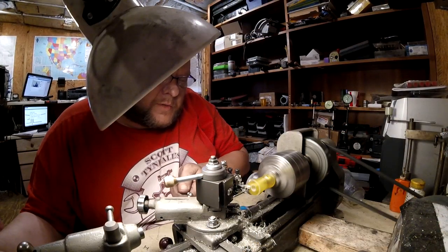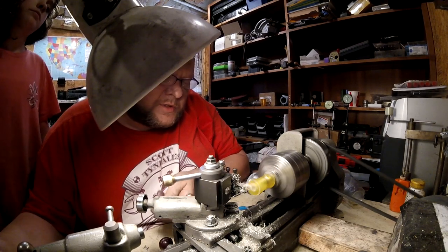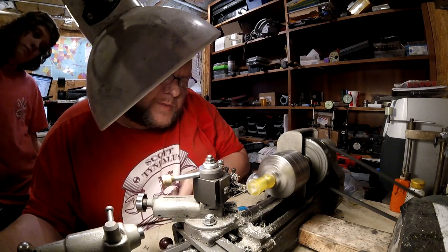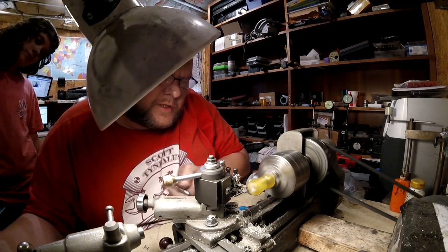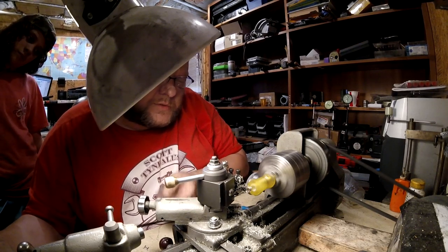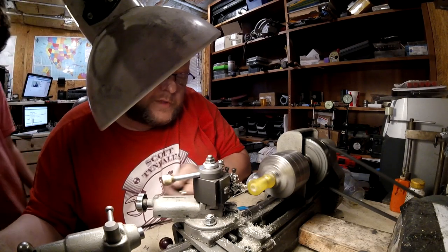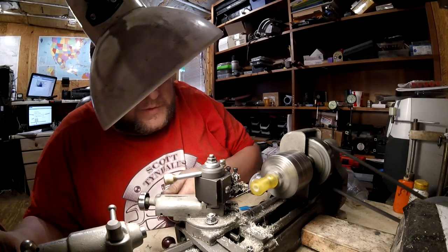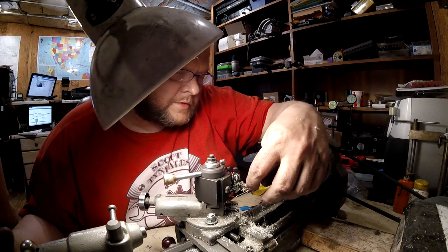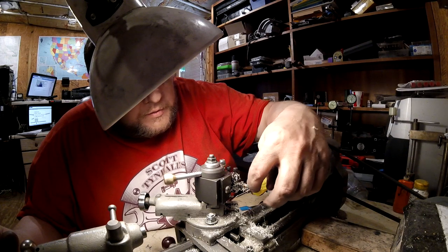And we couldn't get it to cut straight. We tried to cut it with a hacksaw, that was useless. And I thought, well, we're sitting in front of a lathe, put it on a drill bit, chuck it up in the lathe and turn it. That way I can get it concentric or right angle to the center line. All right, turn the lathe off. Let's see how it looks. Yes, that's nice and square edges. It's straight all the way across.